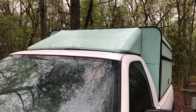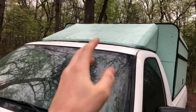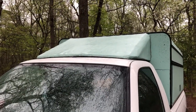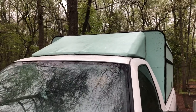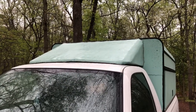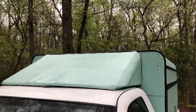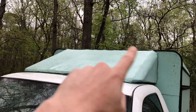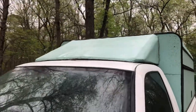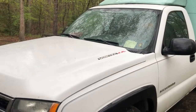At first I used canvas and wrapped it around the whole thing underneath, then stapled it underneath. Then I put some fiberglass resin — standard two-part resin — over the top of that to sturdy it up, then fiberglass mat, and then two coats of fiberglass cloth over the top of that. I tacked it all on with self-tapping screws. The top L-bracket and the bottom strip are my two main mounting points, carrying the most weight and tension.